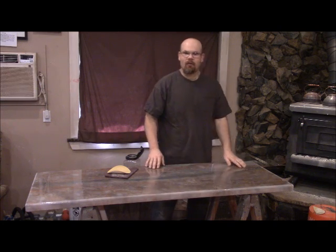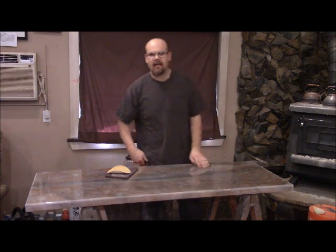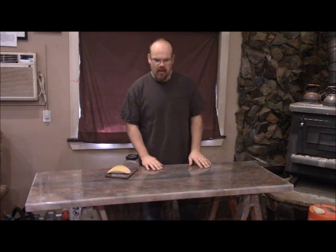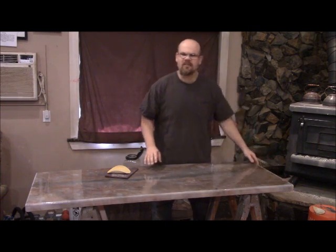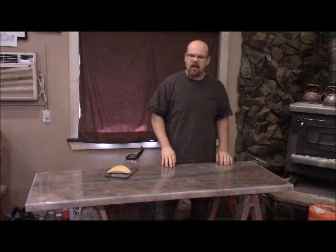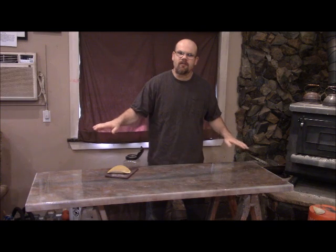We got this top ready for our second coat. It's cured for a day. We did our first decorative color coat. Now, why are we going to do a second flood coat of stone coat? The reason is because inevitably in your first coat, sometimes you'll have a little bit of roughness on the edges. You might have a little dip here and there because the isopropyl alcohol might have created a little crater.